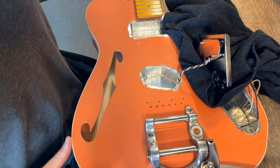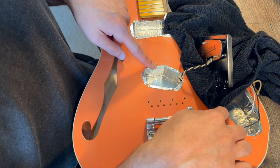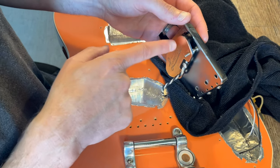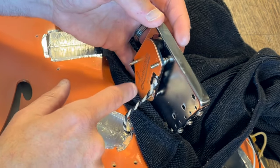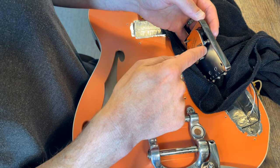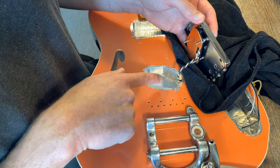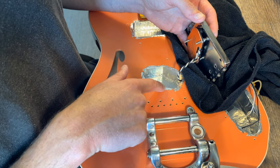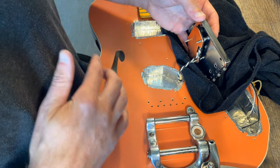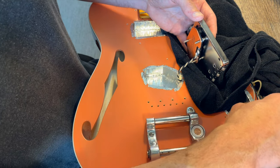Let me explain how connecting these two cavities is going to work. Most Telecaster bridge pickups have a base plate — this is a Lambertones Blondie pickup — and it's making contact with the bridge plate through the screws. The screws contact the bridge pickup plate, the bridge plate itself sits on top of this shielded cavity, and of course this connects to the pickguard, tying it all together. The bridge pickup and neck pickup are also grounded with wire to the back of the pots, making that connection as well.